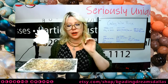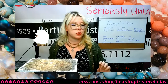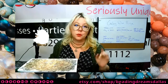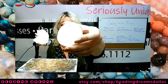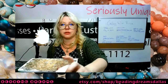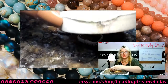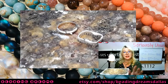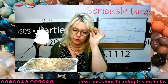So, number one, do as I say, not as I do. Keep 6 to 8 inches of clear space around your torch at all times. That means there should not be anything that is flammable or meltable within 6 to 8 inches of your torch. Fun factoid: I melted the crap out of the lid of this flux one time. See, look, charring, melting. A lot of plastics, after they melt, then they combust. So nothing flammable, nothing meltable within 6 to 8 inches of your soldering workspace.